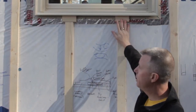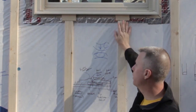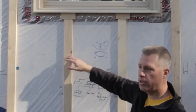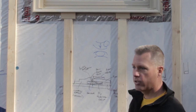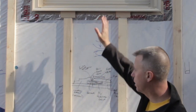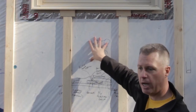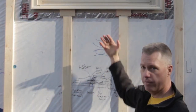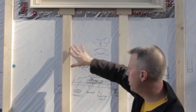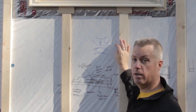So that's it in kind of a 101 sense from the application of siding. Seth did a lot of research and we ultimately found that putting lath strips onto the outside of the house before installing the siding is going to help. As another friend of mine likes to say, the house doesn't want to breathe — it needs to dry. This creates air channels that allow the front of the siding to shed water. Should any moisture get behind it, there's essentially a vent stack for air to channel its way back out and dry the OSB and the back side of the siding, as well as the lath strips. A dry house is a happy house — at least one that's going to last a long time.